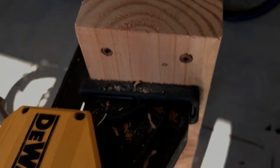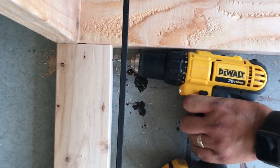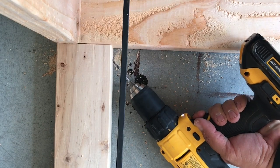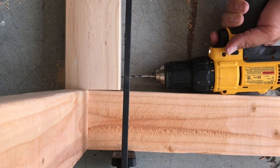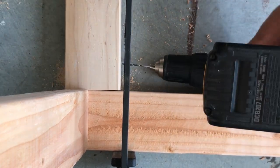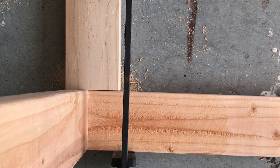For this design I went with a minimum amount of wood because wood also takes up a lot of space underneath your stand. I don't have one of those jigs, so what I did is use the pilot hole, went straight across and then hit it at an angle. This allows me to make the most out of my space with the least amount of wood. They do sell those corner jigs — you just drill into them, it comes with the jig and makes everything nice. But I didn't have any money so I just did it like this, and it does work.